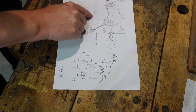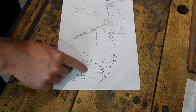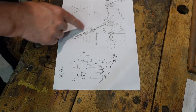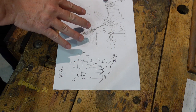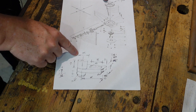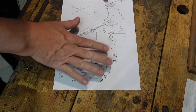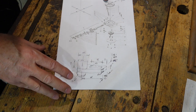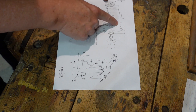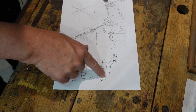Going through and measuring on those axes and scaling, I've come up with a sketch of basically what I think it's going to look like from those scaled dimensions. If this were an imperial part, I'd be saying 19 millimeters is probably three-quarter inch, 12.5 is probably a half inch, six millimeters is probably quarter inch - because designers like round numbers.